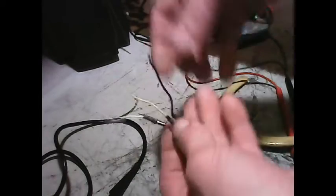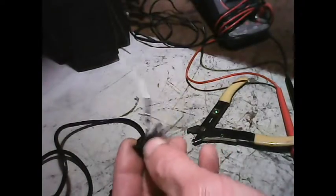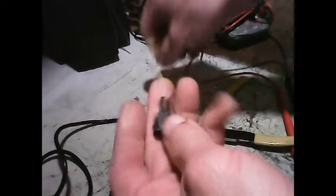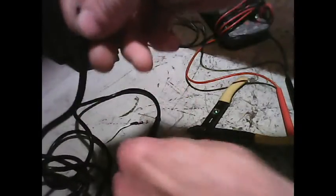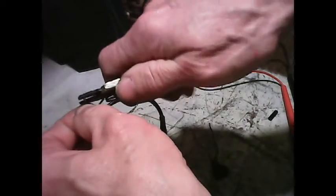That's convenient — this is already color-coded on the socket. We have the black wire and the yellow wire. The white wire has a diode on it, so we can get rid of that completely — we're not going to use a wire with a diode. So now with the yellow and brown wire, I'll re-strip those, and that should just go right into place. We'll get rid of the white and keep the brown and the yellow, then plug it in and see if there's continuity.